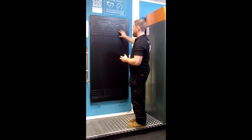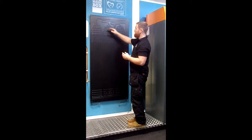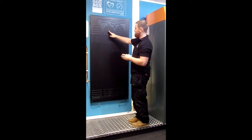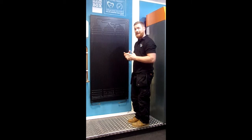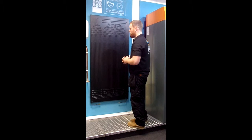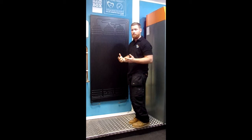As it comes down here to this matrix, obviously we cannot ensure that they're all the same distance, so what we do is we thin these vanes across here. If the refrigerant is passing through the path of least resistance, straight down the middle for example, and it hits this thinned vane here, which is going to increase the resistance, we'll then move across, and move across, and move across, and move across, just ensuring that we get uniform distribution across this panel. Why do we want uniform distribution? Well, that's how we're going to absorb the most amount of energy.